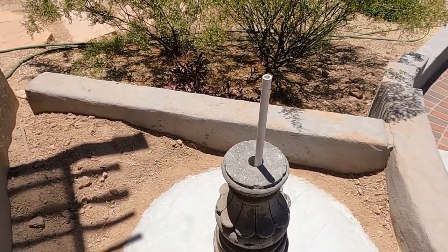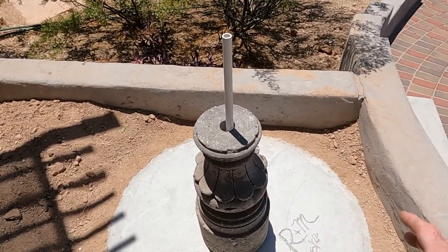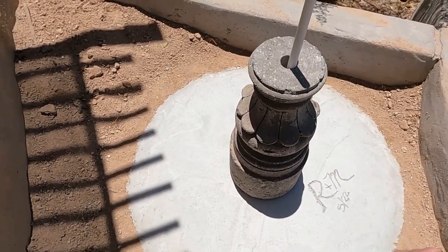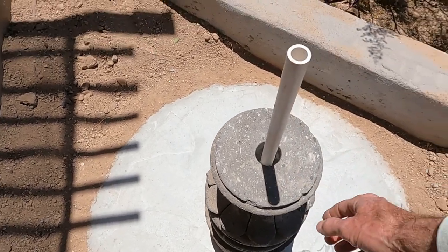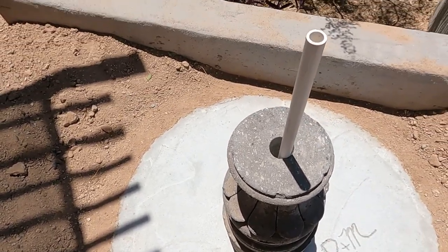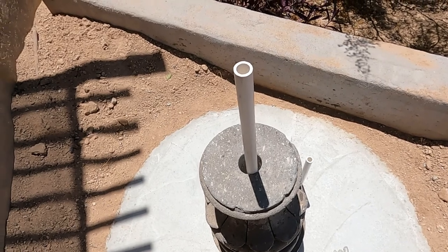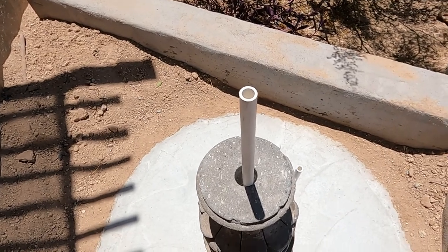And my next steps are to, like I said, put that ring around, getting it set up before I mortar it. Then I'll move everything off to the side and bring the mortar in. And I'm going to mortar the base of this because it's not level right now, and it also kind of moves back and forth a little bit. The pad itself is level. This at the bottom just needs some mortar down there to provide a more level bottom and secure it. Since I'll be stacking the rest of the fountain on top, I want to make sure it's in place well.